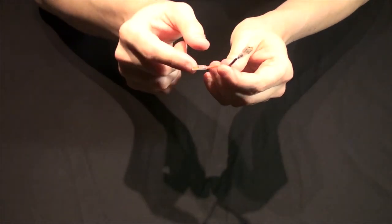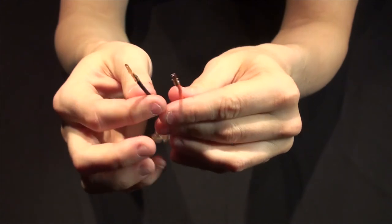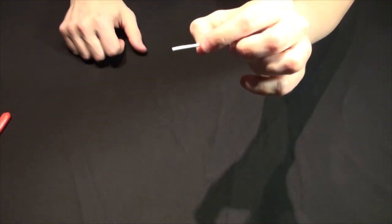I've gone ahead and pre-made a couple of them. You can see these have the wide female spade receivers with a nice small plastic cover on them, and a smaller male spade on the other end. But we need a third wire, and I figured that'd be a great way to show you what we're doing here. You'll want some wire strippers and a little piece of wire to match the other size, preferably keeping the same length. These are a little bigger than the 24 AWG we're using elsewhere, but you can use whatever fits the quick disconnects.